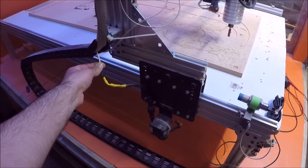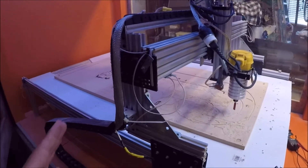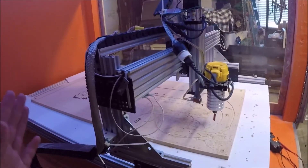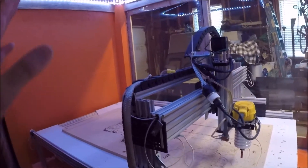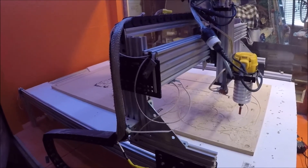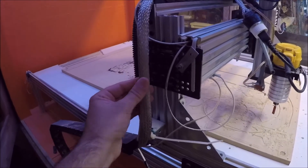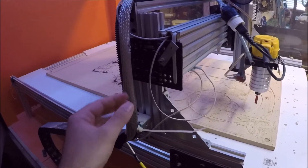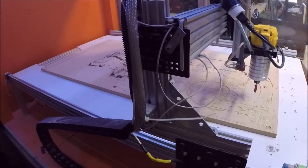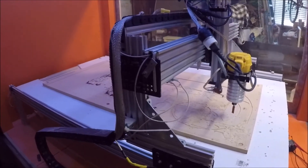I still have another cable to address: the power cable to my router. Experts say not to run the router power cable in the same drag chain as the signal wires for your stepper motors, but I really like the clean installation and don't want to deal with more wires. I've seen people route power cables up on strings above their CNC — it's better, I'm sure, but I don't like the way it looks. So to address the EMF coming off the router power cable, I've installed a braided aluminum shielding sleeve over the SO cable routed to my router, and I've bonded that sleeve to the ground terminal in the control panel so everything stays at the same potential and any escaping EMF is captured.